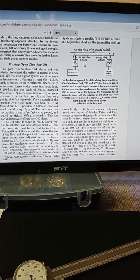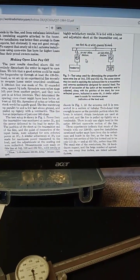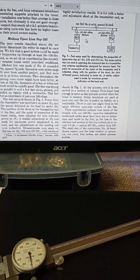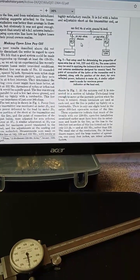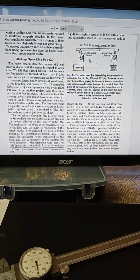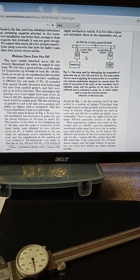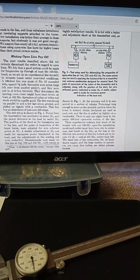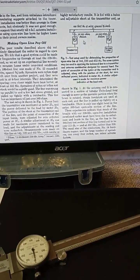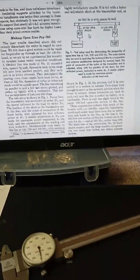Open line allows coupling to anything else out there in space. Losses, fields going in some direction that's not good. Whereas concentric line is self-shielding and almost always keeps most of the field inside of it, so it's not lost. The plus there is, while the loss might be the same, you don't have fields spewing off an open line that are impinging on fields from the antenna and cause changes in antenna pattern. There's another downside of twin lead that isn't obvious if we don't understand electromagnetics.